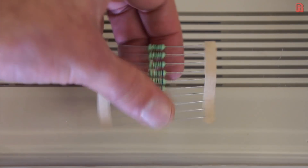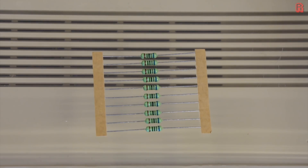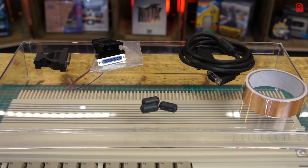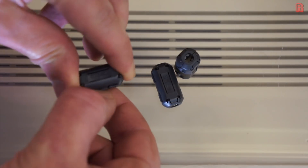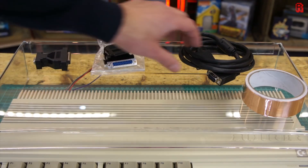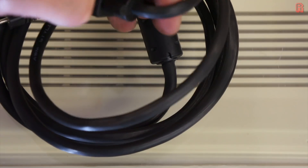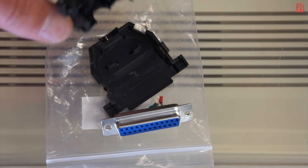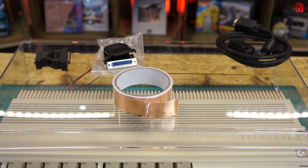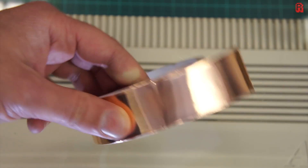The first thing I'll be doing is adding a 680 ohm resistor to the C-sync on the Amiga's output, to bring the voltage within the 3.6 volt maximum rated for the GBS board. This step was recommended by Ian Steadman on his blog, linked in the description. I'll also be using ferrite rings to suppress high frequency noise on the video and power cables. I'll make a new shielded video cable and also try self-adhesive copper tape, which costs just £2 for an entire roll — available online or at your local garden centre as a slug and snail repellent.